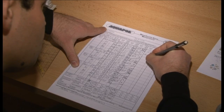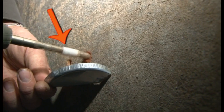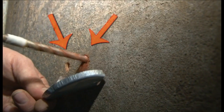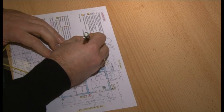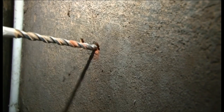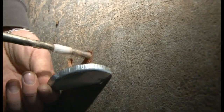In this manner, one measures and documents several sites of the building that needs to be dried out. In order to access the same areas when performing repeat measurements for comparison, all points of measurement are marked on the floor plan. When performing repeat measurements, one chooses the same sites on the wall to obtain comparable values. The drilling material, drilling depth, and so on should be about the same as those at the previous measurements.